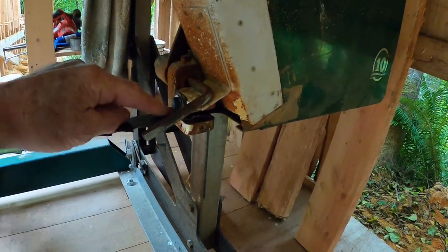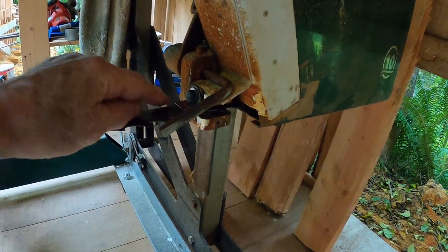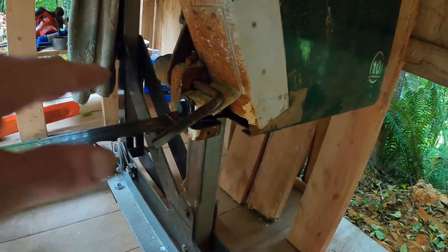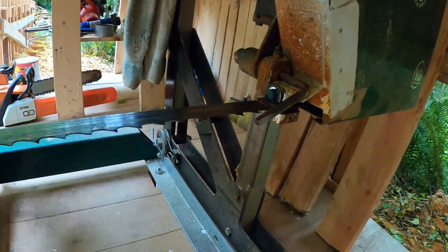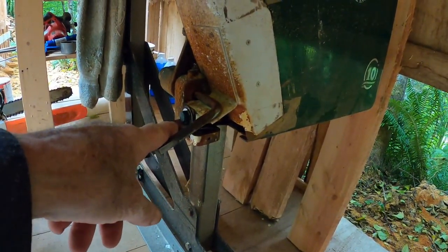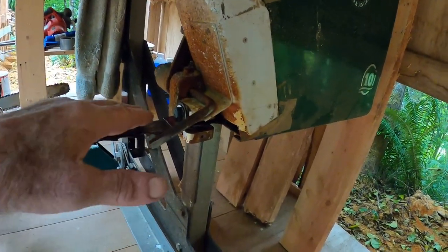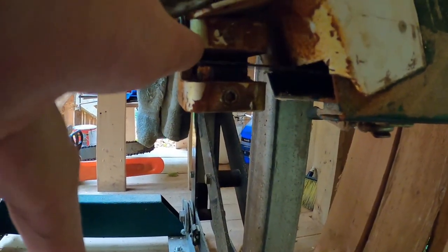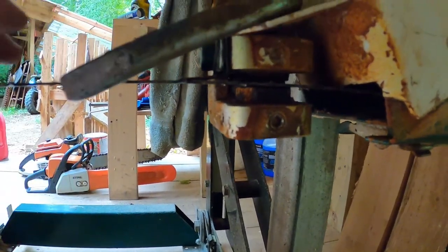The drawback to this was the very cheap metal — it's enameled metal, it was part of the lid to a barbecue grill. I needed something a little springier. Just before I broke my first blade, I made a new scraper out of a bow saw blade, but that was too stiff. Even with heat, I couldn't get it to bend tight enough, because there's very little clearance here — this has to be a very tight bend to stay above the blade and just touching it.